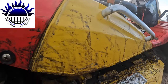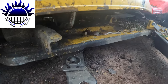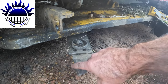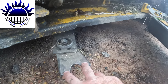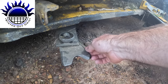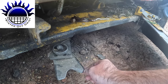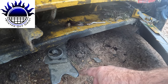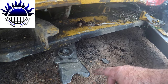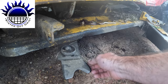So this thing just opens up, pull that back. Now, looking at that blade, the blades are turning that way. So that's the good side of the blade. I've reversed these blades around. So this was probably the first 6 months. And even that blade there, I can still sharpen that. Now, that's 6 months of work chopping down little trees, hidden rocks, big rocks, all sorts of things, you know. And it's pretty blunt there, and it's rounded off.